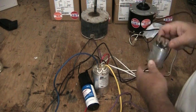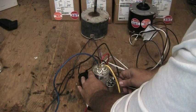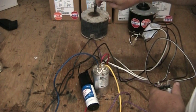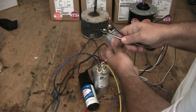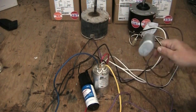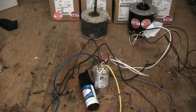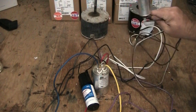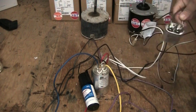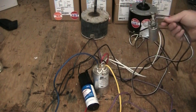What I often do is take the new capacitor from the new fan motor and zip tie it to the side of the old capacitor, or if there's a big bundle of wires in the control box, zip tie it to that bundle. You just need to put this capacitor somewhere it's not going to wiggle loose and touch something electrical. It doesn't matter if you mount it with the terminals pointed up or down — however you can fit it inside the control box so it stays out of trouble is perfectly acceptable.